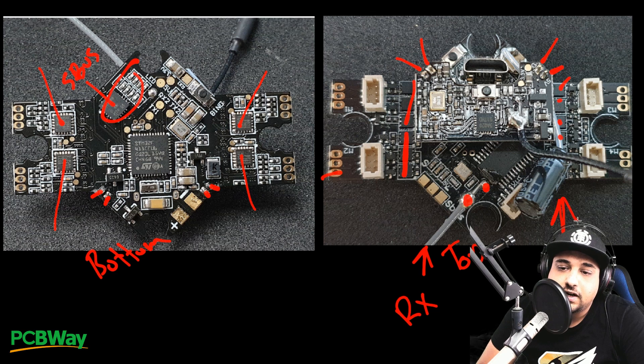They've also added a low ESR capacitor here. I like how they've routed it with a plastic tube shielding covering the pins so they don't short out — a nice little touch so it doesn't stick out anywhere. It's levitated as high as that board, so it's not taking any extra room. I'm also guessing this area right here, you can add your own S-Bus receiver — this would be inverted S-Bus since we have an F4 here. There are a lot of little pinouts: RX1, 5V LED, TX2, RX2, TX1 — you could probably use those for something else if needed.